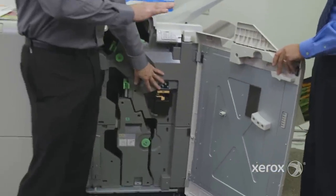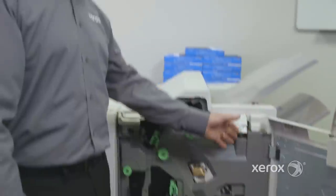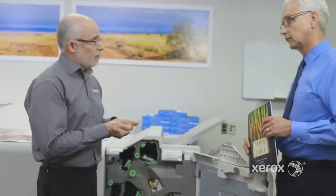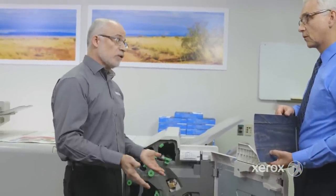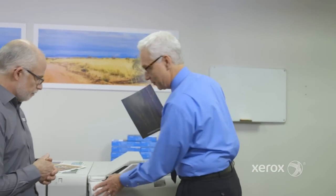What was enhanced in the stacking and stapling tray area was the stapling capacity for coated stocks. Now we do 100 sheets for flat stapling of uncoated, and for coated it's now 35 sheets. There's also a variable length stapler — variable length stapling means that depending on the size of the set being stapled, the legs are trimmed to a consistent length. So whether you have a two-page stapled set or a 100-page set, the legs bent on the underside are all the same length, giving you a perfectly sized staple.